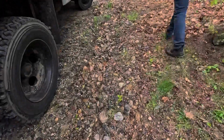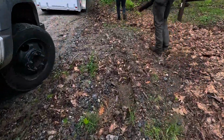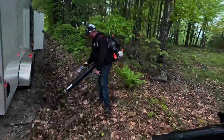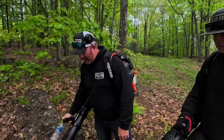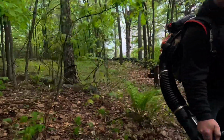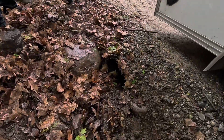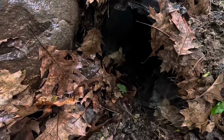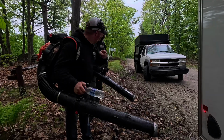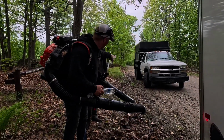Look what happened here. Okay? This water shouldn't even be here. It all went up and over the culvert, because this culvert was clogged. When we got here, I kicked the leaves and crap out of the end of this culvert to open it up. That's all it took, my feet, to free that culvert up. But the culvert was clogged with all this stuff, and the water was washing out this guy's entrance. So instead of going in and washing out the end of the culvert, it just went up and over the road. This culvert is supposed to cross, and that would relieve some of the water from running all the way down to your crossovers, so that would have never washed out.